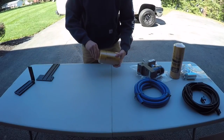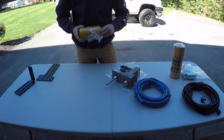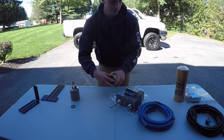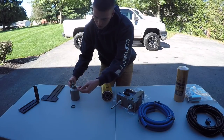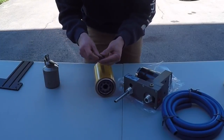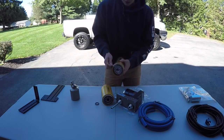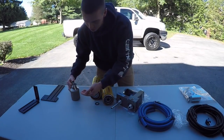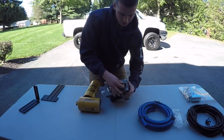First thing I like to do is go ahead and put the filters on because I really don't like these threads being exposed. So to get that covered up as soon as I can, that is the way to go. When you put any filter on, you want to make sure that your gasket has lubrication on it — so it doesn't stick when you're taking it off, and so it doesn't falsely tighten it; it actually gets a smooth, nice tightness. I've got some fresh oil here and I'm going to run around this gasket, and then this one here as well.